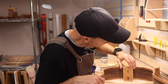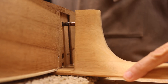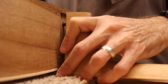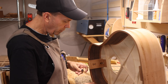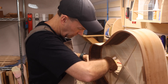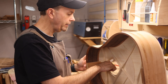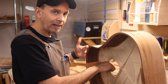We're ready to go ahead and try a test fit. Now that this bolt is fixed in here for the captive bolt, we've got to screw that in first. From there we can go ahead and put in the top bolt. Now I can tighten this top bolt all the way because it's drawing in those two button head screws into the grub screws, which creates that pivot lock so that it can be tight because they're in parallel with this bolt.